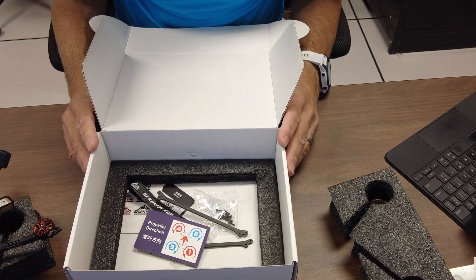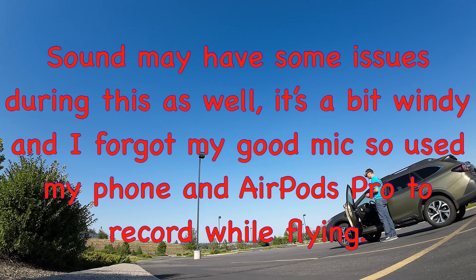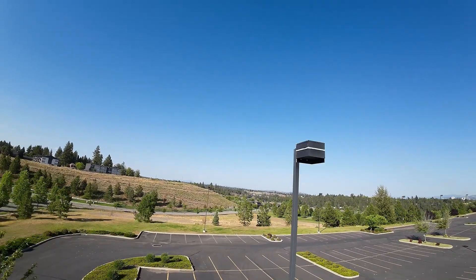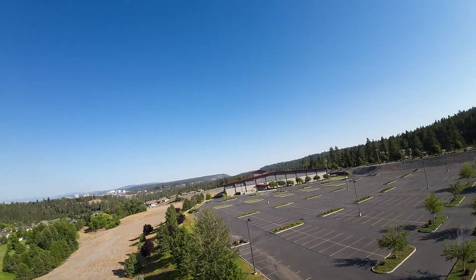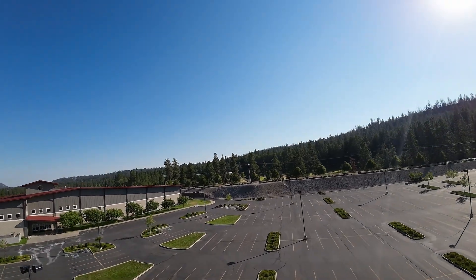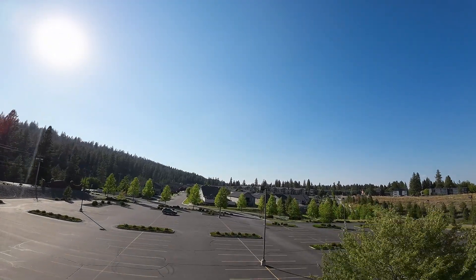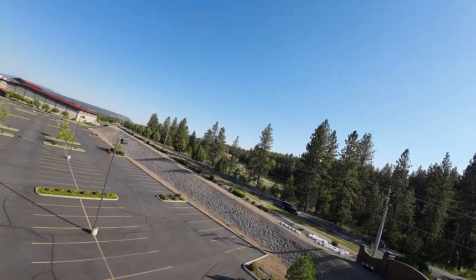Let me get this thing programmed up and then I'll get it up in the air and show you some flight video. One thing I did notice is I got into ESC Configurator because of the BLHeli-S ESC and noticed it was set for 96k Hz. A lot of people know by now that with the O3 you can't be at 24k Hz for the motors because it can cause some real problems. I'm just going to cruise around a little bit to get a feel for it. Goggle view looks really smooth, so that's nice. We'll see what the stabilized video looks like.